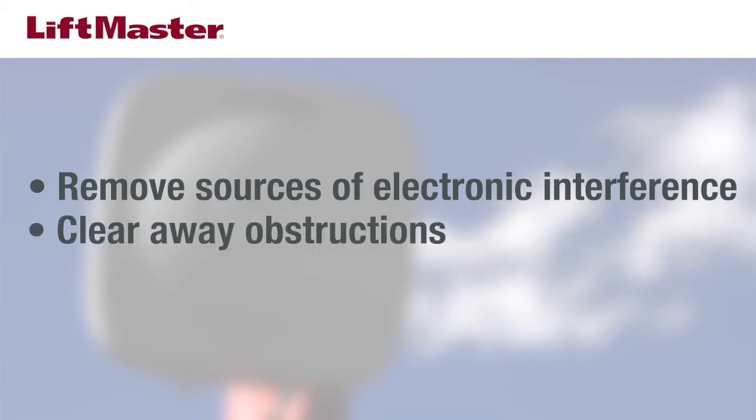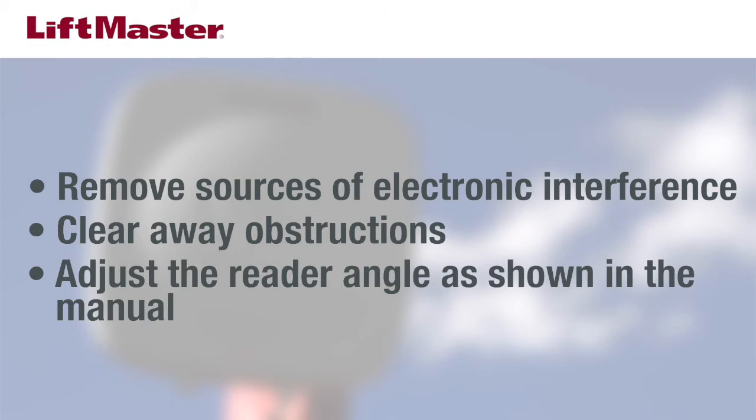Obstructions such as tree branches or plants, and metal posts and gate arms. Clear away obstructions or relocate the reader so there is a clear line of sight between the reader and the tags. Adjust the angle of the reader. Check the manual for more information about optimal position.